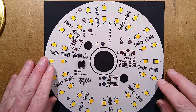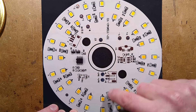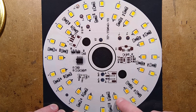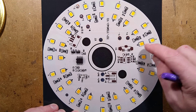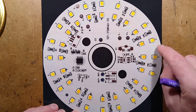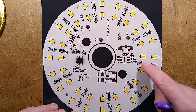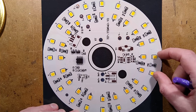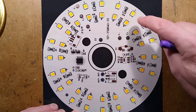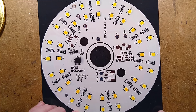The bottom circuit board is literally: USB in, a decoupling capacitor, one resistor for the two LEDs, charge and standby, the programming resistor on that chip, the output with a decoupling capacitor, and then the lithium cell — outputting roughly about 4.2 volts. The top circular circuit board has the touch sensor chip and two MOSFETs, then one common positive bus that runs around inside the LEDs. The cold white LEDs are marked Y — which usually means yellow in Chinese — and the warm white are marked W, though they've got them reversed. There are 10 pairs of each colour with a 16 ohm resistor per pair.